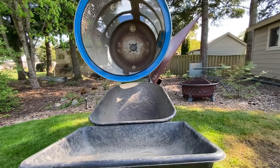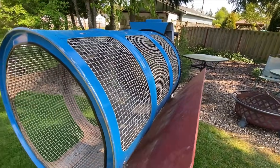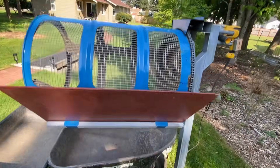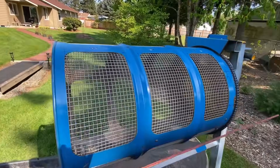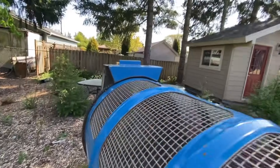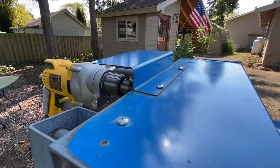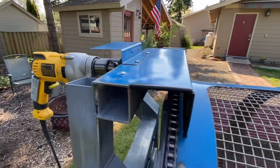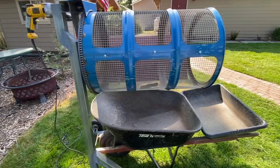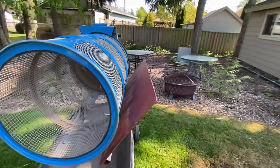There's the guard mounted — you can see it goes right into the wheelbarrow. It's a little wimpy, just quarter-inch thick plywood with two brackets, the same color as the drum. I used the steel dropouts from the drum as parts to make it. This right here is a finger guard to keep your fingers out, and then this little one on top is really just to keep the spindle from getting so wet when it rains. The whole thing is going to live outside except for the drill.